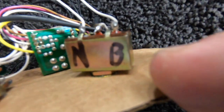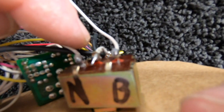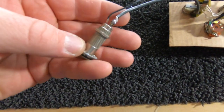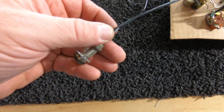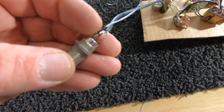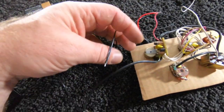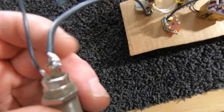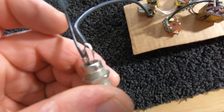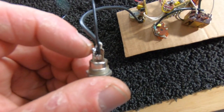The switches from the big switch for the pickup selectors — there's your positive for the neck and your positive for the bridge. And it all comes out to the jack. It's a stereo jack because it has to be in order to use the active electronics. The little itty-bitty part right here takes the negative wire from the battery, the white goes right there on the right-hand side of where the battery comes off, and then we have a braided ground that goes to the left side.